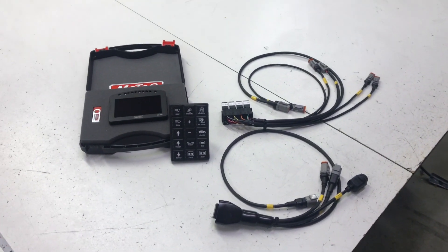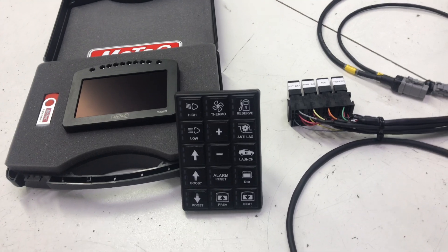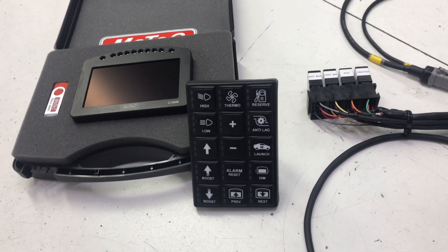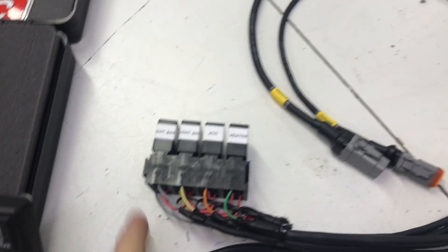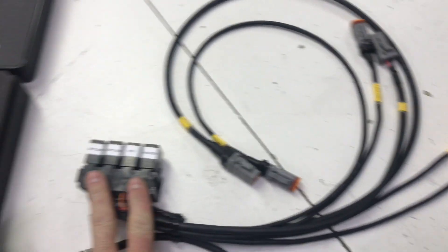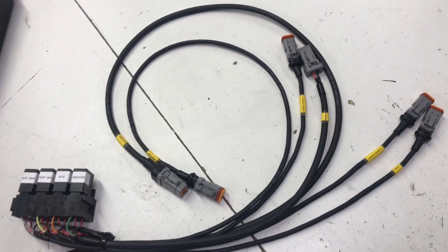Here's the project as far as the wiring. We have a C125 here with a keypad that's going to be turned to the side. A lot of people don't think they've always got room for a keypad, but you can turn them to the side and maybe get different functionality when it's in its vertical position. Here's a relay block that we built — this is all kind of built to order for this specific project. It gives us four outputs when we do the I/O enablement, so we're going to be able to control four relays.